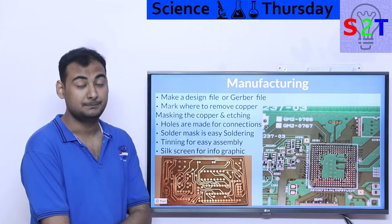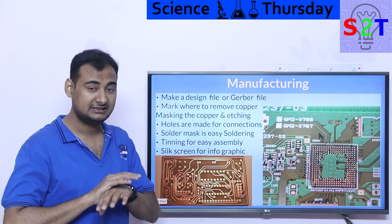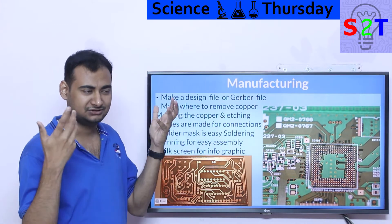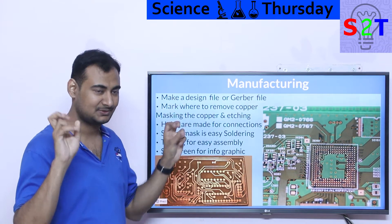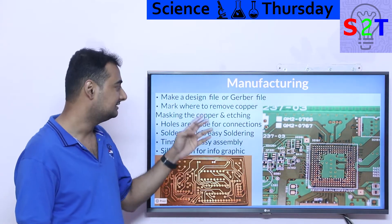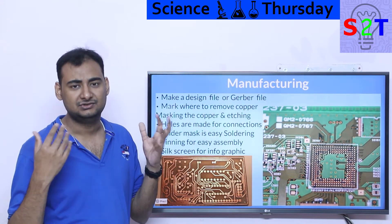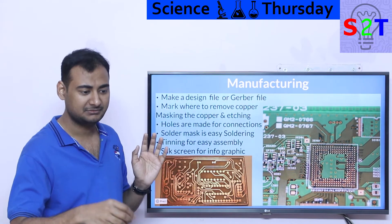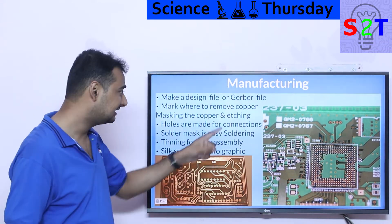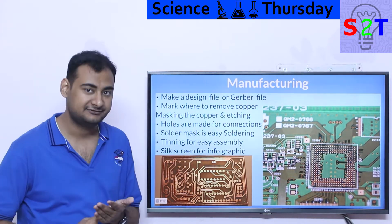So how do you manufacture a PCB? This is a big industry with a lot of proprietary secret sauce, but the core process is the same. You start with a design — in old days it was hand-drawn, but nowadays you start with what's called a Gerber file. Think of the Gerber file as the JPEG of the PCB industry — it's standardized so any manufacturer can take it and produce your PCB. You can use other formats, but Gerber is the common standard you'll hear about.